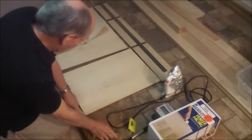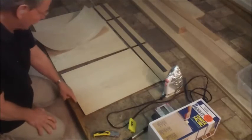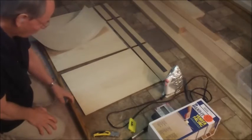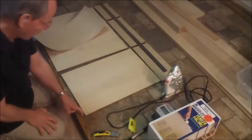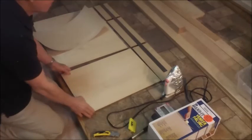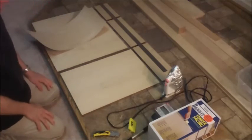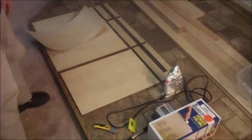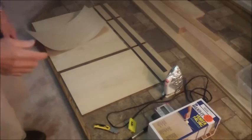When you're doing the cross cut section, going across the grain, definitely don't go too close, because you can chip the edges. So you want to go about 1/8 of an inch and then use the trimmer to trim it off. Basically, that's the way it worked successfully for me, and then I will show the frame in the next video.